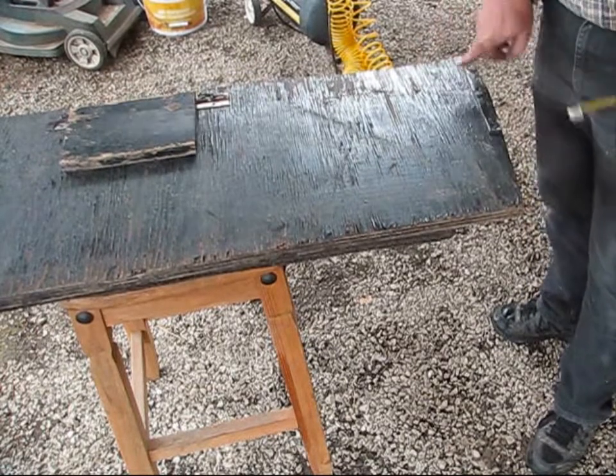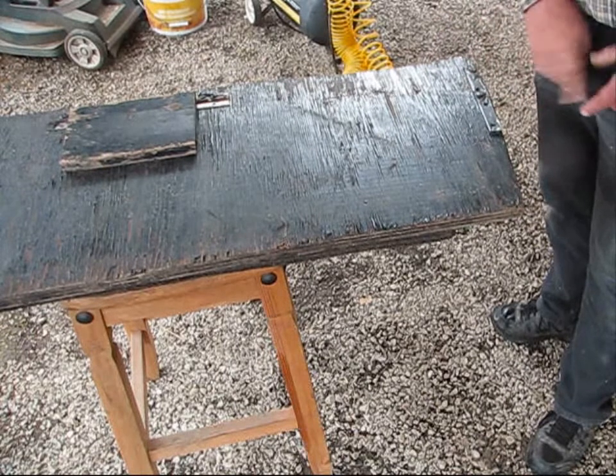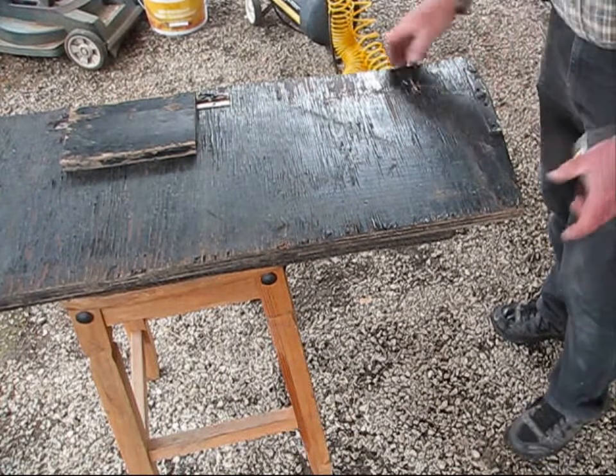These are actually steel reinforcement plates, and the ends you're gonna have, these are just regular straight reinforcement plates, and then the ends you're going to have some L brackets because that's what's going to bolt to the boat. You'll need to tap your holes according to the holes on the boat on your spacing.